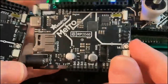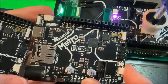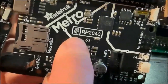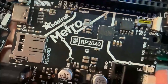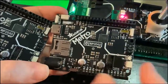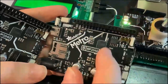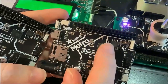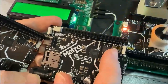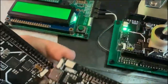These are the final Metro RP2040 PCBs that came in. It's kind of neat — it's rare that you'll see an 'A' circle on our boards, which means the first revision worked. Usually you'll see a C, D, or even an H when there are many revisions. All the GPIO are tested working, I bumped up the flash to 16 megabytes, and there's an RX/TX switch so you can swap those pins, plus buttons, STEMMA QT.